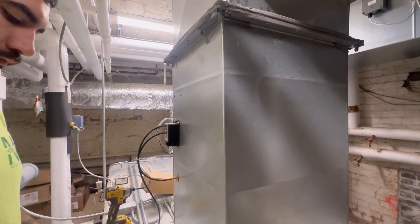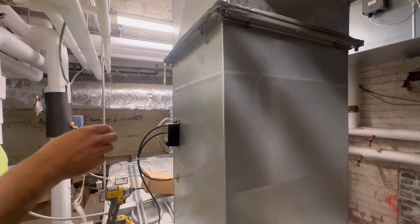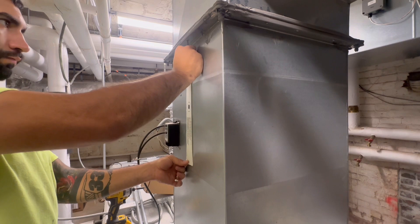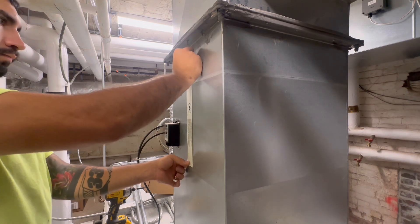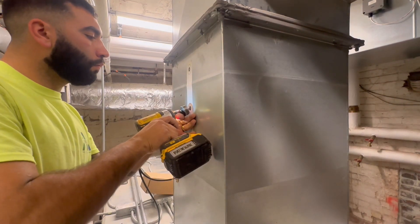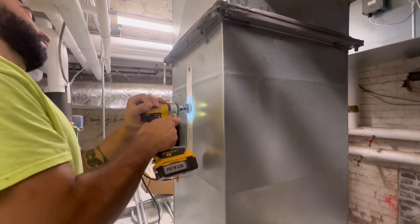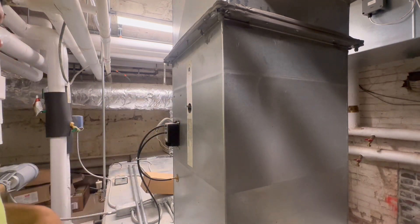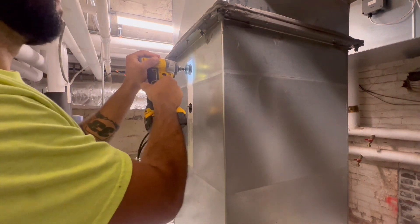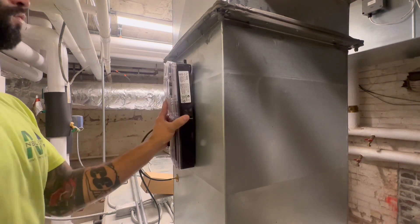What's going on everybody — just a quick video of me showing how to install a duct sensor housing for a duct smoke detector. To start off, I found the center of the duct, laid the sticker template that it comes with, and then used a mini hole saw bit for metal — about between one inch and an inch and a quarter — to punch out those holes.